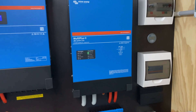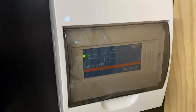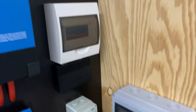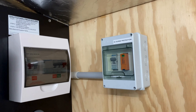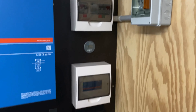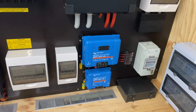There's Slave 1 and Slave 2, and this unit here is the master. Then we've got the Cerbo GX there, and it runs the whole show. There's also surge protection — both AC and DC — and you would have seen that shot before: the lightning rod for the lightning protection. That's a very important part of the system.